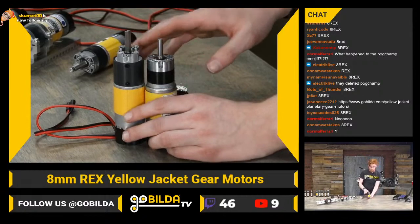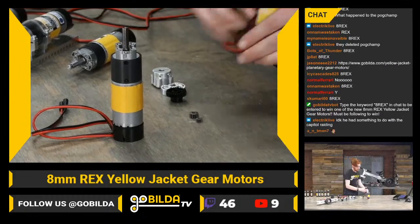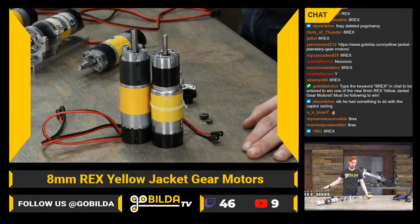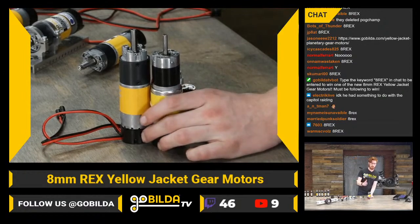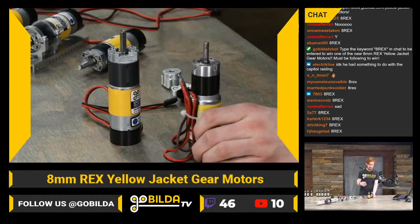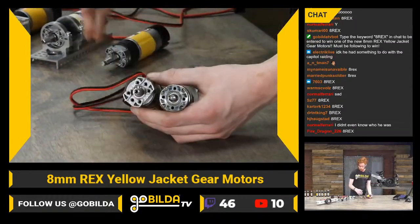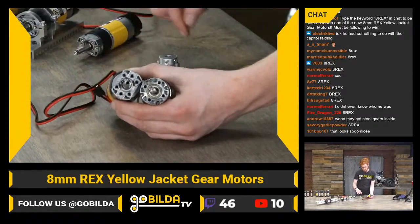On the 5203s, the adapter plate is buried inside the gearbox and the ring gear actually encases it. This means we can make the gearbox shorter. The single stage gearboxes got shorter, two stage are very comparable in length, and the three and four stage gearboxes got a little longer. The gears themselves are larger — it's a 36 millimeter diameter gearbox instead of the old 32 millimeter, which means you'll need different clamping mounts but gives us space for really beefy gears.